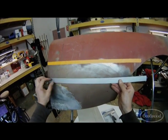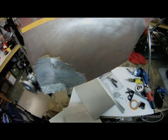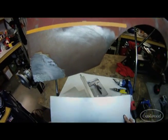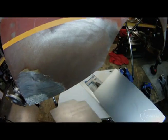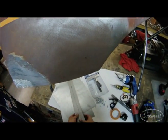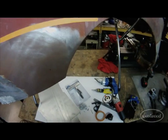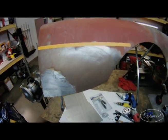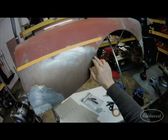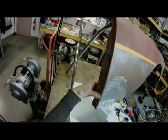Get a bunch of these one-inch wide strips — I'll show you some tricks. These are used as backers to support your patch panels. We've also got 12x12 and 12x24 sheets, so you can do some large patches. One of these kits, depending on the severity of corrosion on the vehicle, could handle everything for a fraction of the price of a replacement panel. What I'm going to do is find the area, come across, flap disc it to get the corrosion off, then start drilling out the spot welds.